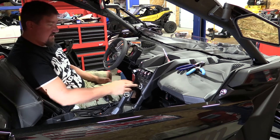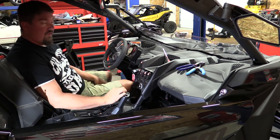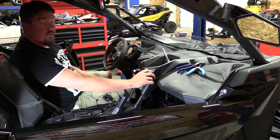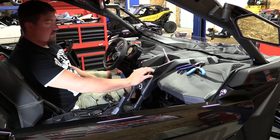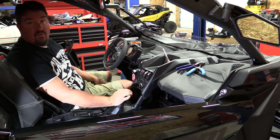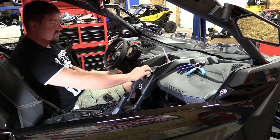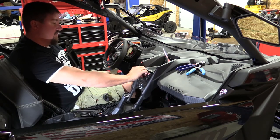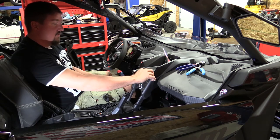Let's do a quick test run. Turn on the power — all of our lights work, but the auxiliary switch is off, so our WARN switch does not work. Turn on the auxiliary switch, and we have complete use of everything. So we are set. Turn the auxiliary switch off, push these switches in — this one's dead.